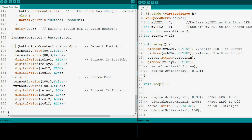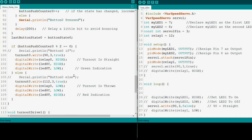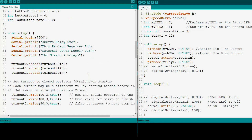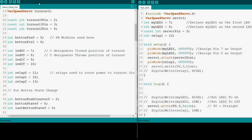I used the serial print line to troubleshoot and see what part of the procedure I was in. But basically that is all there is to it — you just have to identify everything in here. All the pin numbers are right here: pins 2 through 13 on the UNO, all down one end. You don't use zero and one. On the Nano you'll have the same thing, except you have a couple of extra analog pins on the other side — two extra analog pins. On both the UNO and the Nano, the analog pins can also be used as digital input pins.